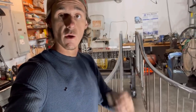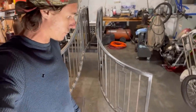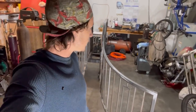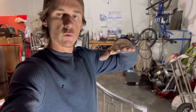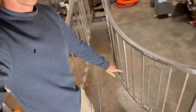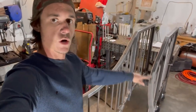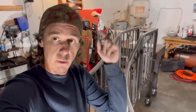I hope the tool list that I laid out for you helps you out in your railing endeavors. That's the end of the video — I just finished cleaning up the shop; it was a wreck in here. I must have picked up 10 pounds of metal dust. I'm definitely going to shy away from curved railings from now on, but you live and you learn. I wanted to get this underneath my belt — this square tube curved railing. With the square tube, it's three dimensions: you got your sweep this way, your downward, and then the actual top of the square tube you need to keep flush so when your client runs his hand down it, he ain't twisting his wrist. If you buy the ticket, take the ride — don't let your customers down.